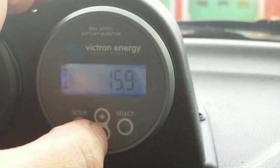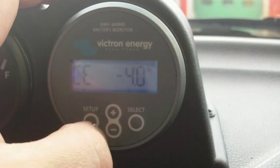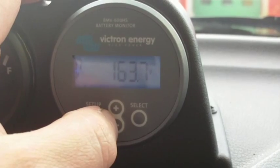We're back to 163.6, now 163.7. We're going to drop out another string of capacitors — 19.5 amps AC currently. Now we're going to switch out another bank, and we're now down to 13 amps AC with two banks remaining.